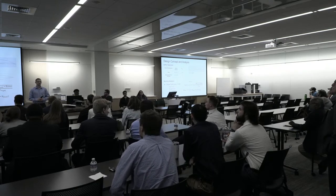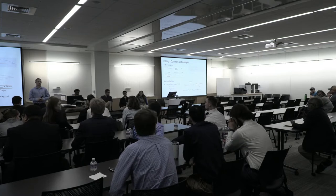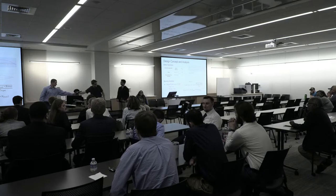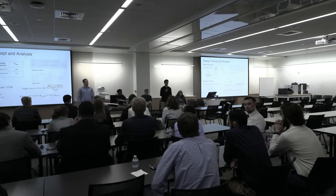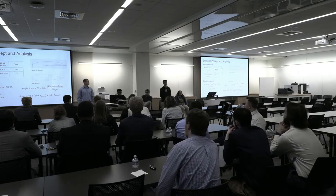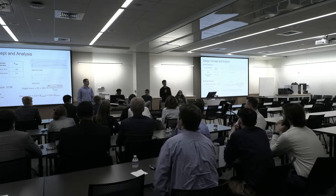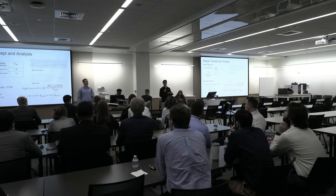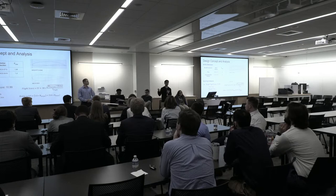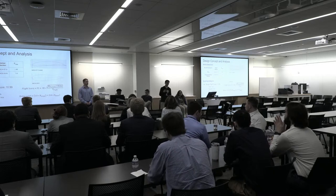Oh, I see. Okay. And did you approach any analysis using software, like any finite element based or any numerical software, like for angle of attack? Yes, we did. For most of the stability analysis and the flight analysis, we used a program called XFLR5, which is a free open software that we can use. And we've tried our best to model the geometry of the aircraft in that software. However, we've been seeing the limits and the capabilities of the software. So there are definitely performance issues that we are not able to address. And there are also definitely some unknowns as to how the aircraft may perform because we're not able to see the full capabilities of the software that we're given. However, yes, we have used software to analyze the performance of our aircraft. Okay.